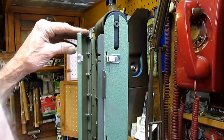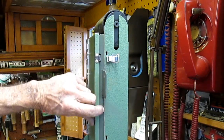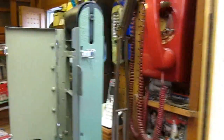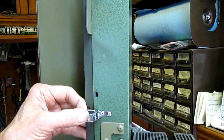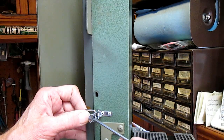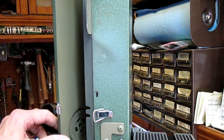Got little latches installed, and they work really well. And the flat bar stop gap filler thing, I had to notch it. The rivets don't stick out that far. They're about flush with the inside of the flat bar. And these little guys, I'll add a link to what I used, but if you pop the little spring arm up between the handle and the bail, I released that spring tension, so it just makes it easier to place these, mark them and drill them. I riveted, it's just simpler.